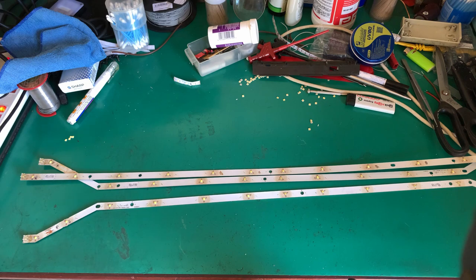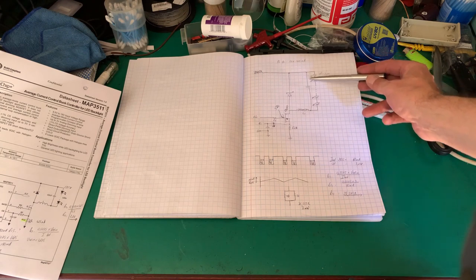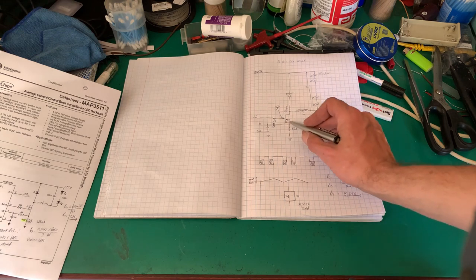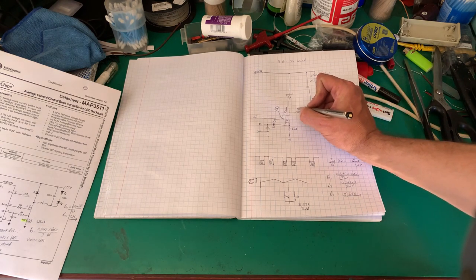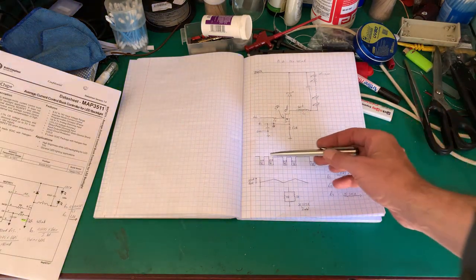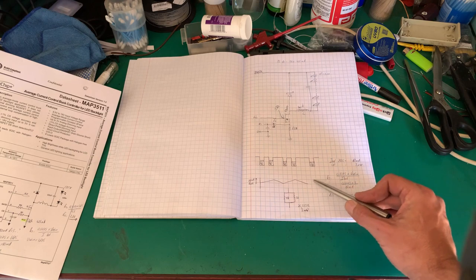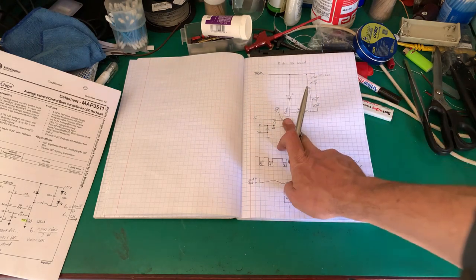the fun part, a little bit of maths, and we'll modify our power board. Right, as we've said, here is our circuit. Importantly, we're worried about this component here, this current sense resistor, which is currently 2 ohm for 425 milliamp, and that inductor there. That inductor currently is 2 millihenry of inductance, and what we said is this chip is a fixed off time. So our off time is fixed, but our on time varies to give us the current flow that we require through the inductor.